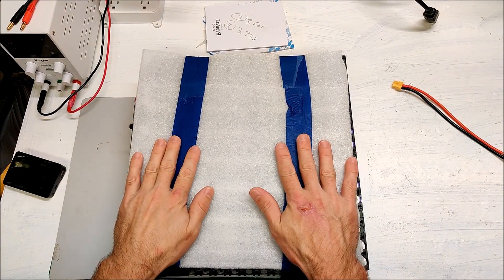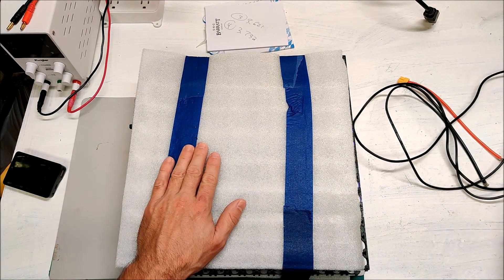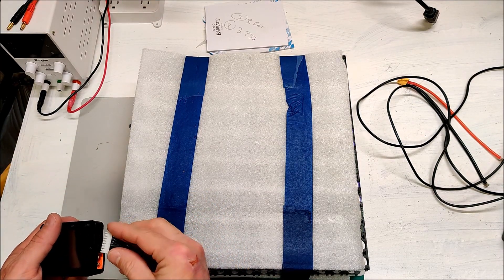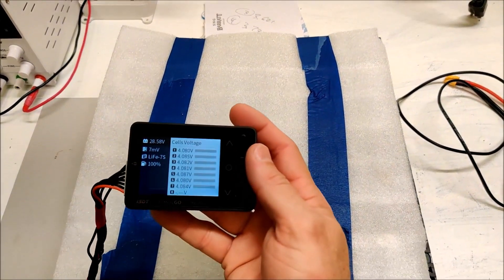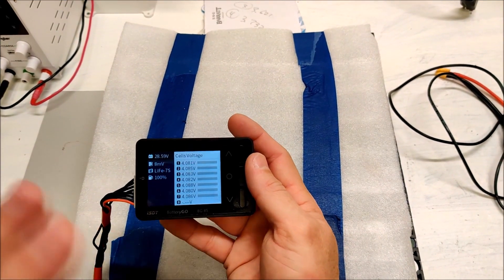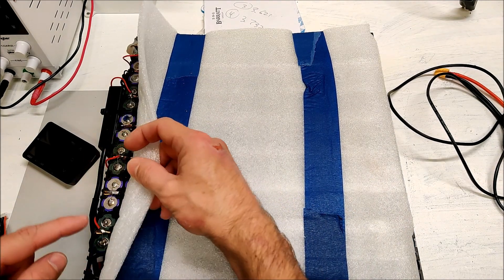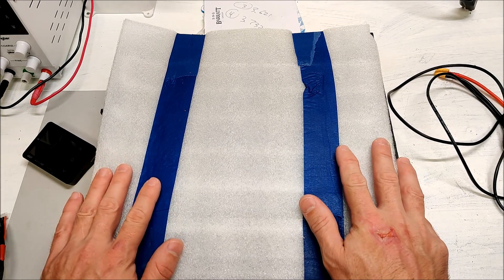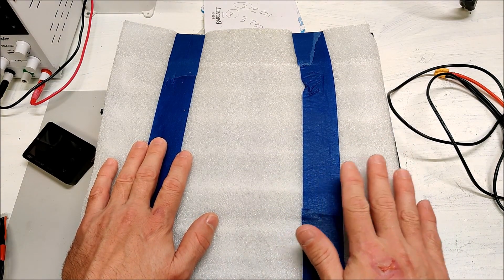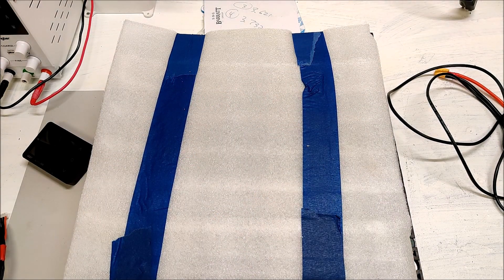I let the iCharge balance this pack, then had to go on a business trip — so that was four days ago. When I left, the iCharge was down-balancing and all the cells were looking really healthy. Now, four days later, every single pack is reading 4.08 volts — nice and healthy. I also went through and metered every single one of all 210 cells. Every single cell metered at 4.08 volts, meaning there are no electrically disconnected cells, bad fuses, or cold solder joints. Every battery is properly soldered and part of the pack. This pack is ready to go into service — we are done.